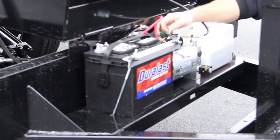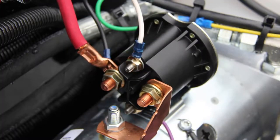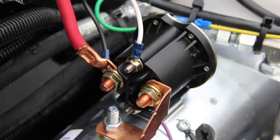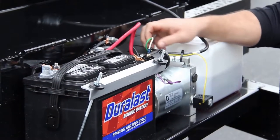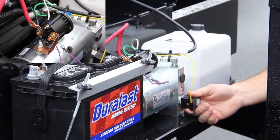You have a black wire, a white wire, and a green wire. Your black wire coming out is power that runs to the power side of the solenoid, where your red cable for your battery goes. The white wire goes to the very top post on your solenoid and is your up position. The green wire coming in is butt-connected into the yellow wire, which runs into the coil, which drives the spool valve.